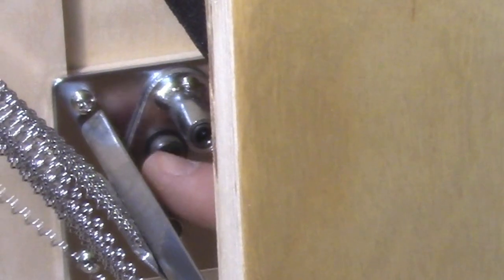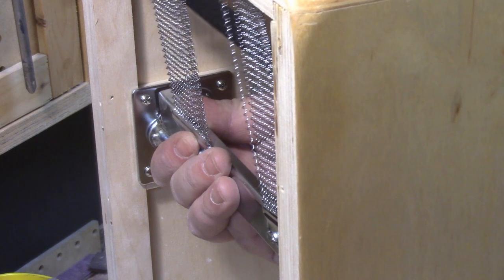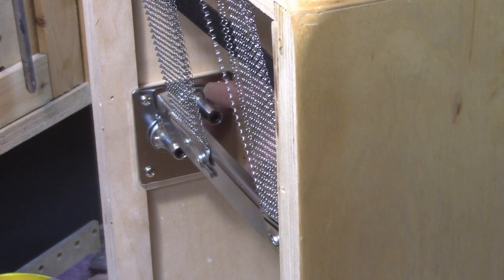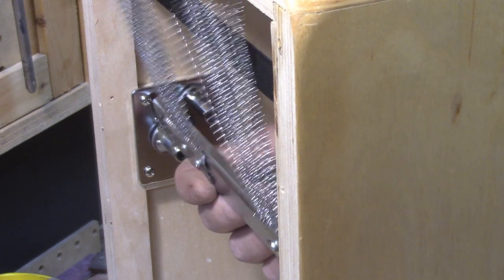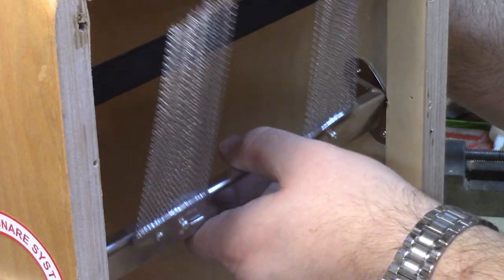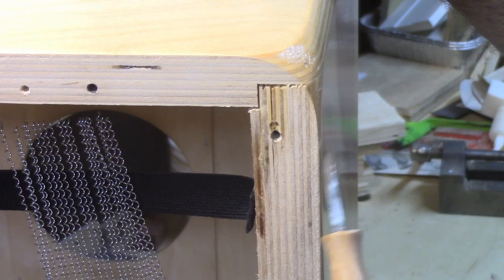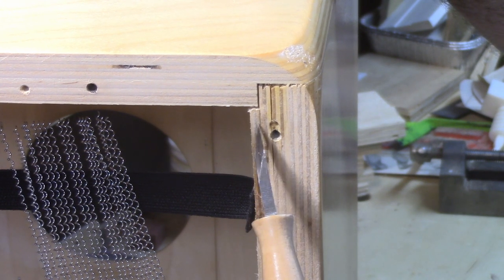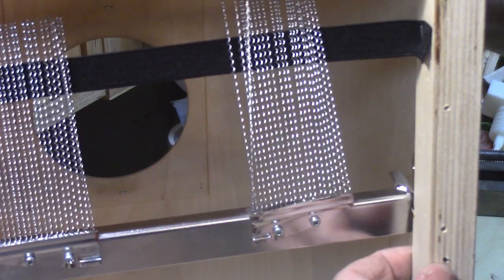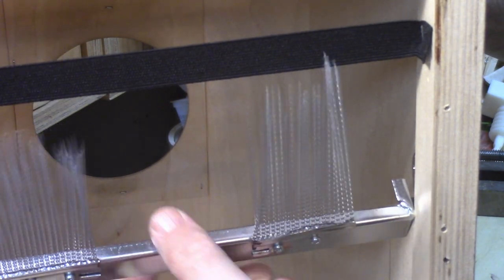So right in the center here is a hex screw. It seems to be kind of loose. So the ball part of the detent here isn't being pushed in to the actual hole that is supposed to catch them. And then over on this side here, there is an extra piece of plywood here. So it goes from the outside here all the way over to here. And then there's just that little bit there that they added on. I'm not sure what this is here for, but it seems to be interfering with this really going into the detent.